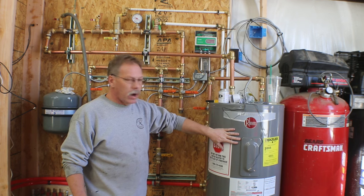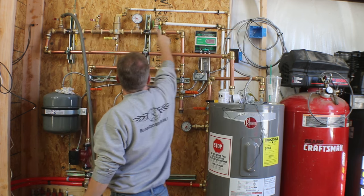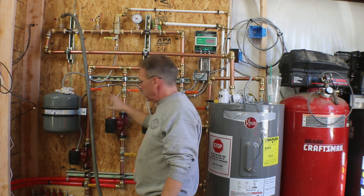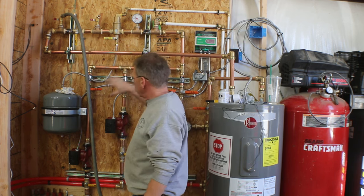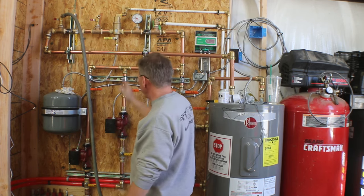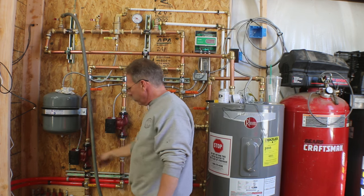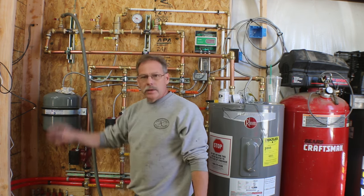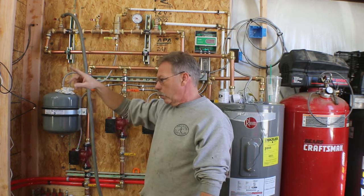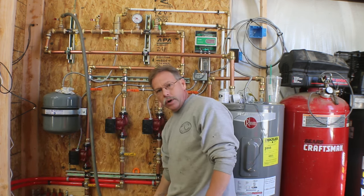I'm gonna go ahead and turn the hot water heater on, let it start heating that water. Then with the hose on this valve, we can force water into the system and fill each one of the circuits on their own, because this is both pump one and two, or one zone, but we've got a bunch of loops on those two pumps. So we can bring water in, and we'll start with pump two. We'll let water through. It's gonna go into the hot side, send water over to the manifold on the other end of the shop, and then we'll open a loop, and it'll eventually push water and all the air back out here and into our garden hose again.